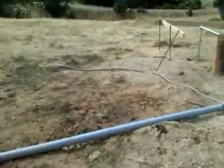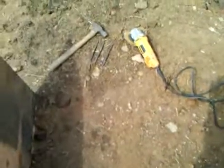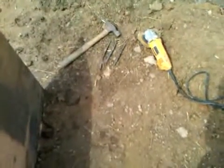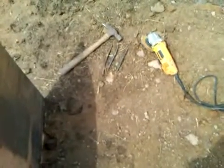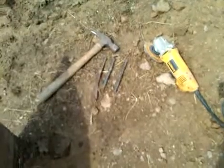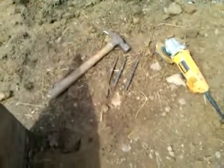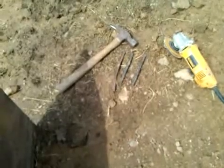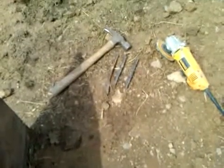With the pipe cut to the right length, I also had to put rebar steel in the bottom of the pipes. Engineers require this in case wind load causes the two tons of PV panels on the racking system to try to lift out of the concrete, even though the piers are 42 inches deep. I used a grinder to cut a slot in the metal at the bottom of each pipe, then hammered a piece of rebar through it so it sticks out and sets in the concrete, preventing any pipe from lifting out.